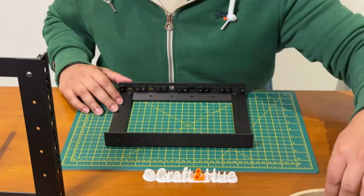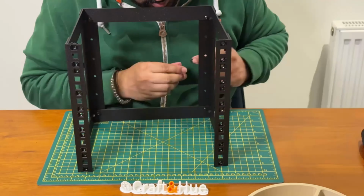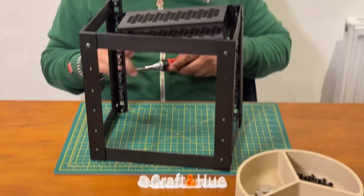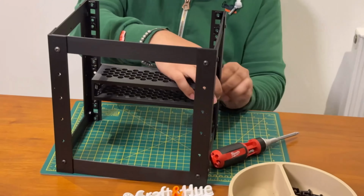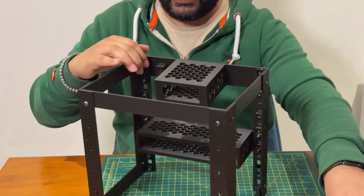Before installing everything, I pre-fitted the standard size cage nuts and dropped in the blank keystone inserts wherever there were unused ports, just to keep things tidy. I also pre-wired the keystone using a rather lovely purple Cat 5e cable I had left over from another project. I might as well make use of it, and honestly, a pop of colour behind the scenes doesn't hurt.